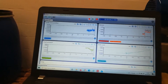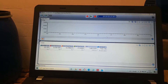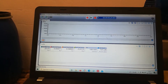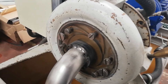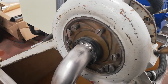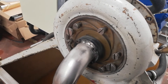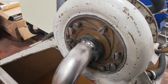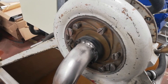We can see that the speed is now ticking along at 170–200 rotations, just counting the number of rotations. At this low speed it's possible to see the runner inside the turbine rotating. The guide vanes around the outside introduce the water tangentially onto the runner. The water goes through the runner and exits out the stainless steel elbow, which is the draft tube, back into the tank.